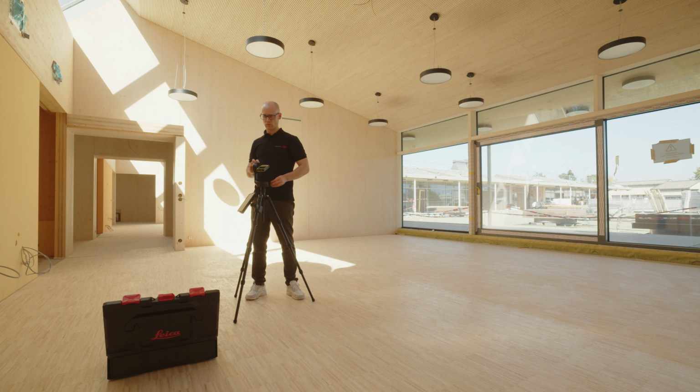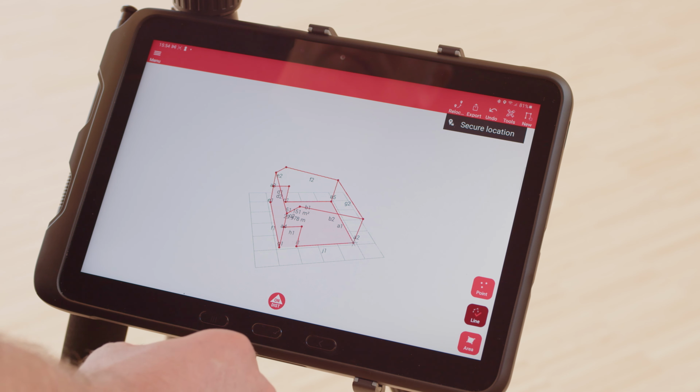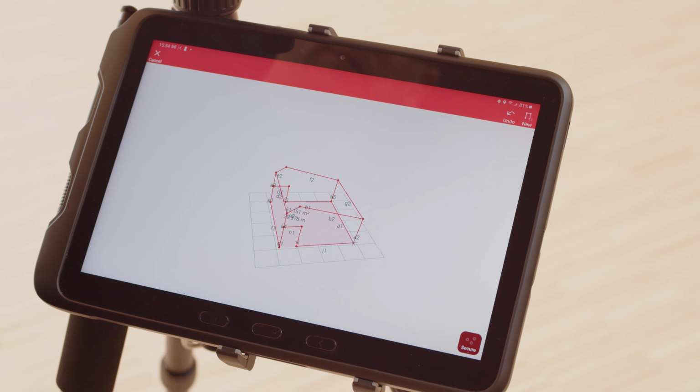To save the current locations for later continuation of your measuring work or to do a relocation within the current drawing, you can save 3 secure points. These points should be apart from each other and well visible, even at the new location. Relocate the DISTO to a new desired place when additional measuring points can be added.